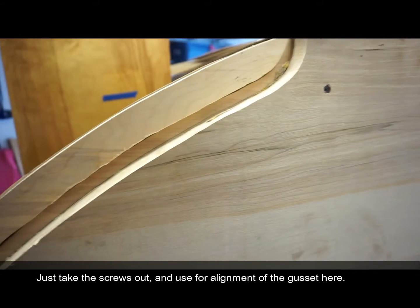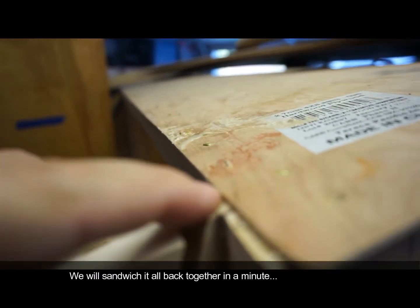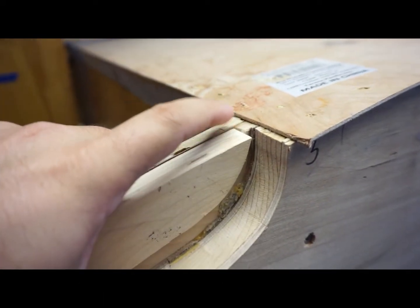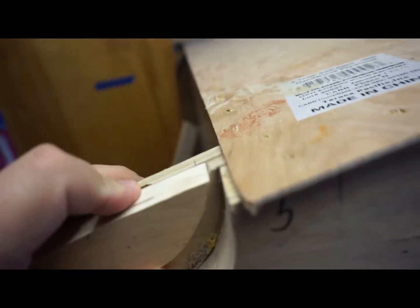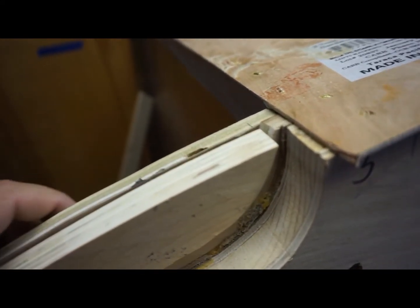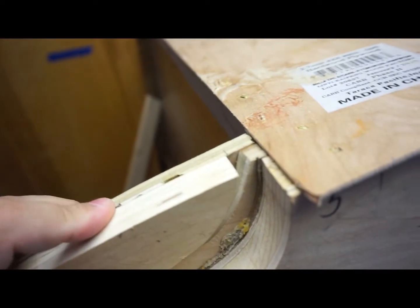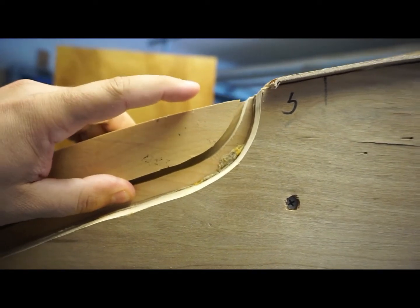The proper location for all of these parts is so that the outside profile matches. What I'm indexing off of is this top notch right here — I'm indexing off the top of the seal piece that I cut because I know that's true to the profile of my trailer before the skins are put on. So I pull my gusset up to where it meets that. I've already drawn a line here — you can see that little line right there. It'll probably take an extra hand to do this, but with that line I pull it up and hold it right there, then line up this piece.